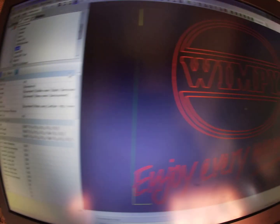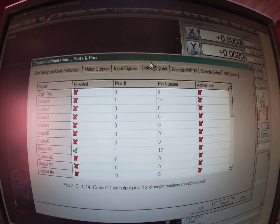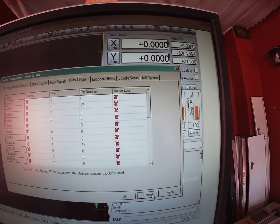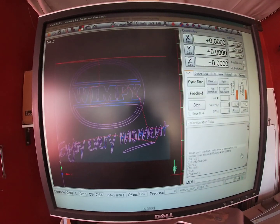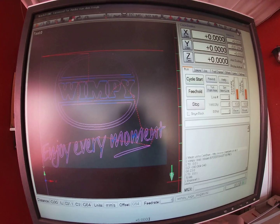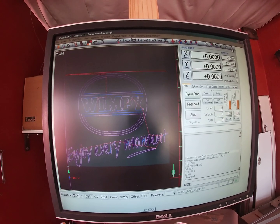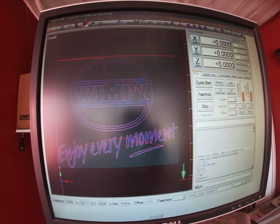In Cambam, once you export this file, Mach3 has all the knowledge you put in to use all the systems for laser engraving. I must say that this version of Mach3 is not the same one I use for my spindle setup - this is a separate setup. I believe it's easier to create them separately rather than switching between them, because if you still have your laser setup for normal CNC milling there will be a delay, so it's better used separately for laser setup.